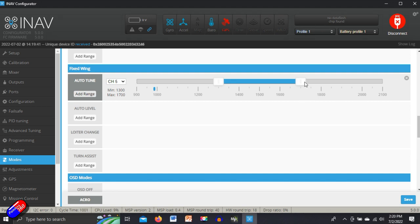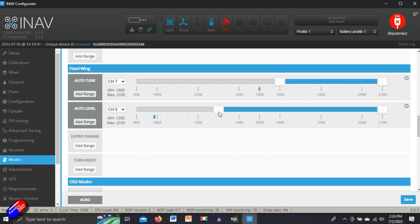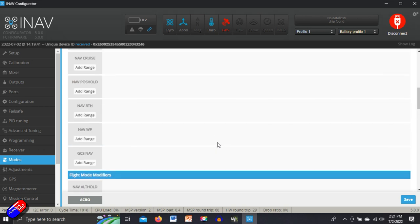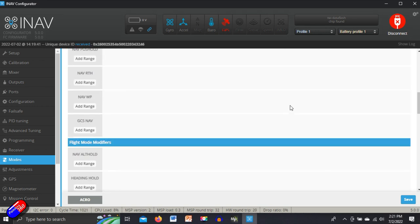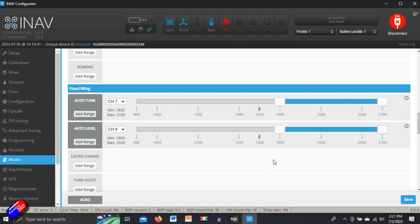I would then add two more switches for two more modes. One is auto tune — I would set that for a channel, probably like channel seven, just a spare one not being used for anything else. The other one is auto level. That is really handy because what auto level allows you to do is, as you start flying and you turn auto level on, INAV will figure out what the attitude of the plane needs to be to fly straight and level. Once you've done that, all the servos can be trimmed to give you that same attitude in manual mode. Always have manual — in the event of something going horribly wrong, you can put it back into manual and fly it back yourself. And acro where no mode is set is needed to go through the auto tune.